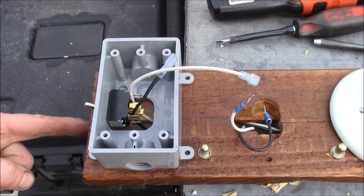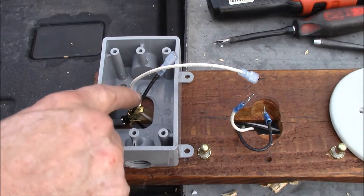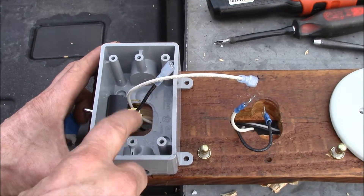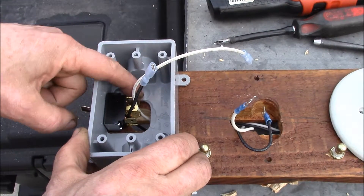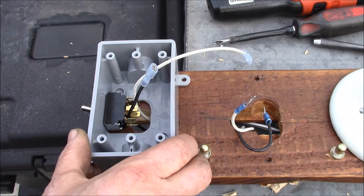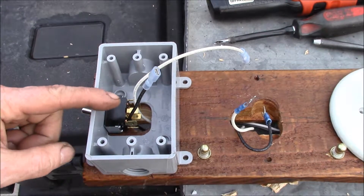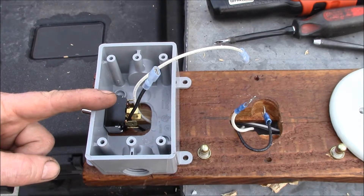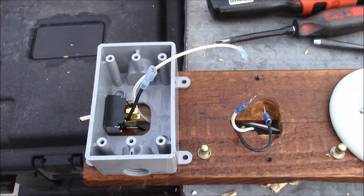In one position it'll take just the incoming power — I'll have a power cord coming in hooked to one side of the switch. The other side of the switch can be hooked to whatever I install in the box. So if I want to put a light dimmer in here, I can install one and run it through the other side of the switch. I could dim all of these light bulbs using z-wave in-wall dimmers or regular light dimmers, and I'll also be able to measure the power consumption with the dimmer and one or more bulbs.